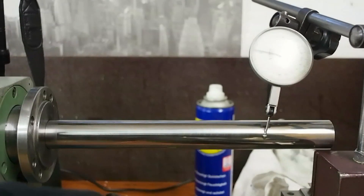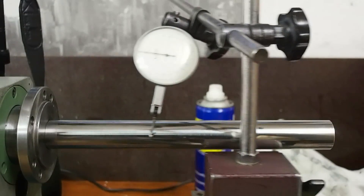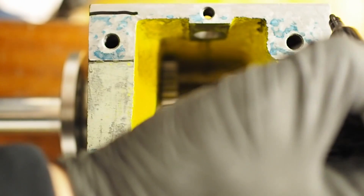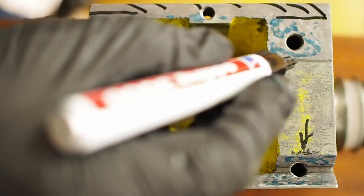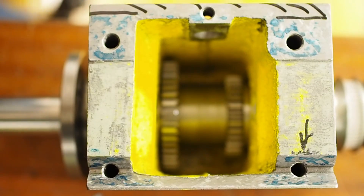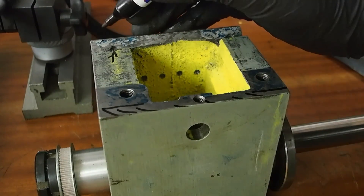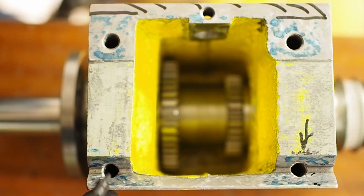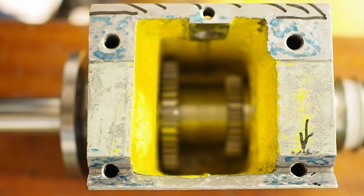I've now scraped it so that the horizontal alignment is within limits — it's coming out at about two ten-thousandths, which is right on the limit that Connelly gives, and I'm pretty happy with that. The bearing's not perfect. Everything outside of about this line is off the side of the bed, so there should be no bearing there. We do have bearing right throughout the area where the bolts go, and bearing on both sides of the V-way around these bolts. I'm not going to try and scrape it anymore — these ways are only about nine millimeters, maybe a little less than three-eighths of an inch wide. I'm just not good enough at scraping to improve it much more, but I've got decent bearing at all four bolt locations, so we'll clamp it down and see if that's enough.